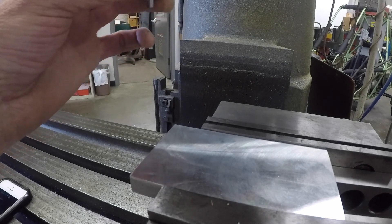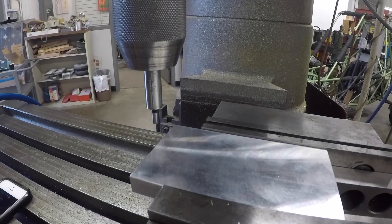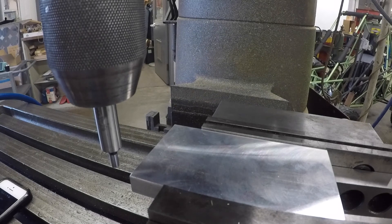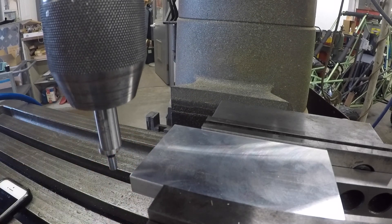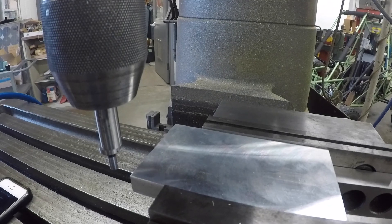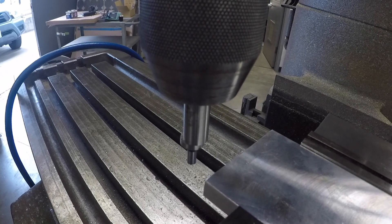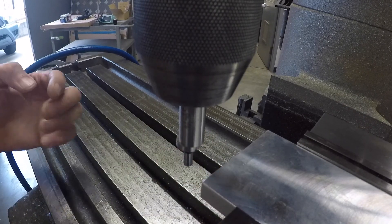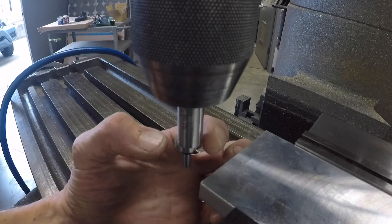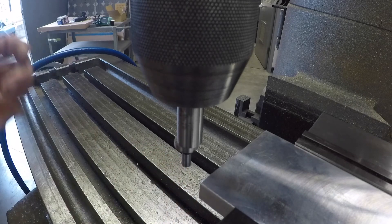So I'm going to put this in the drill chuck and bring the mill up here. What I'm going to do is knock this out of concentricity, and then slowly bring it over — I'll narrate as we go. I think that's a pretty good view. What's going to happen is I'm going to move the table up to this edge. This part is going to start to go into concentricity, meaning it's going to be all round. And then as soon as it kicks out, which you'll see, that's the edge.